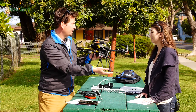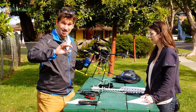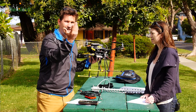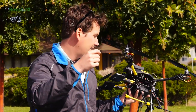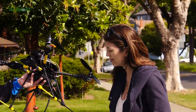Since we were talking about 1090 megahertz, that's 27 and a half centimeters. So this is half of that. And it's literally just a pigtail. This is like, what, 16 gauge? No, it's just 18 gauge wire that has been soldered onto a circular connector and put in line with the SMA, where the SMA reaches the F-type adapter here. Oh, that's so funny. Yeah, it's just been screwed onto there. That's it. That's all you need.